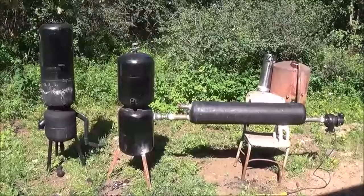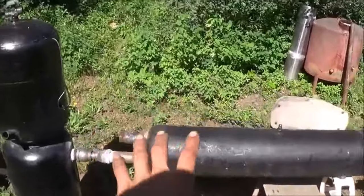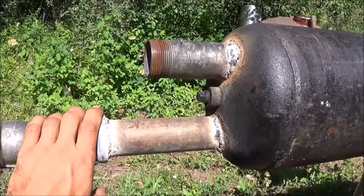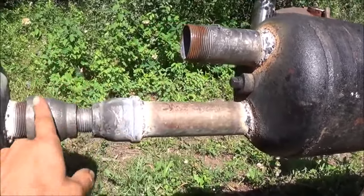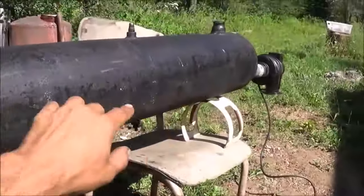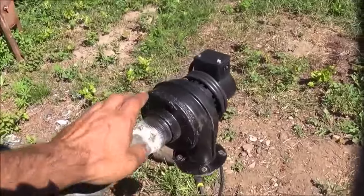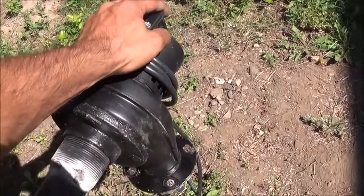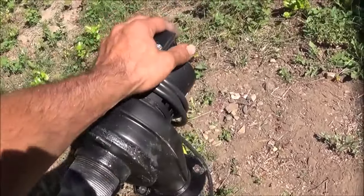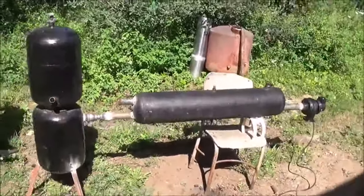We're going to do a quick test fire-up of our little mini gasifier. I've got my water tank ready to go — I think it's an air pressure tank. I've hole-sawed a couple holes in there with a one-and-a-half-inch piece of pipe going all the way through, connected to our gasifier with a coupler. The wood smoke will come out of the gasifier, go through that pipe through the middle of this tank, and we'll fill that tank full of nice cold water. Then the smoke comes out and into our draw fan — I've reversed the fan from the larger one so it'll actually create a draw. We're going to fill it full of wood and give this our first primary test fire-up.